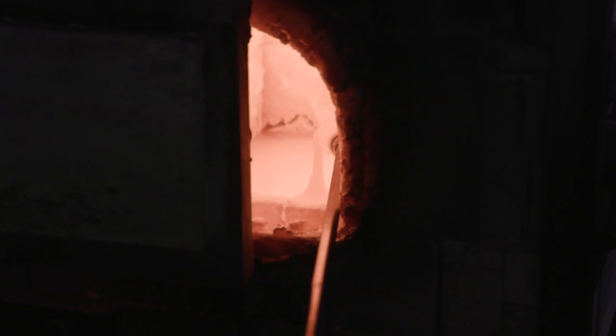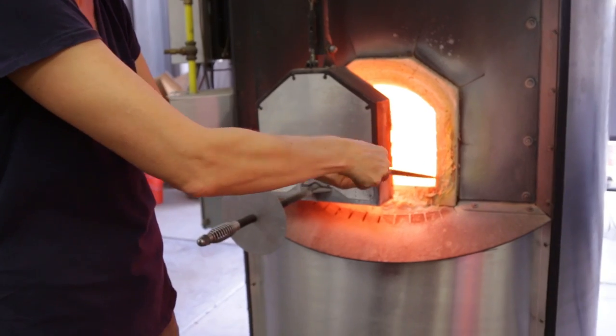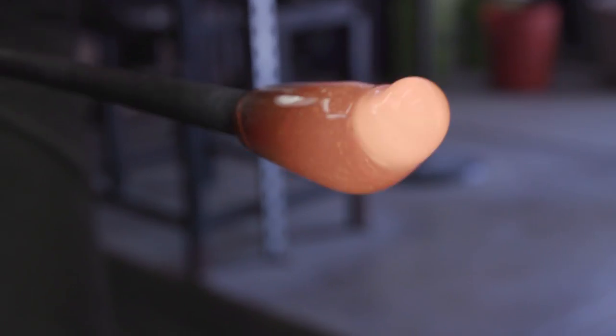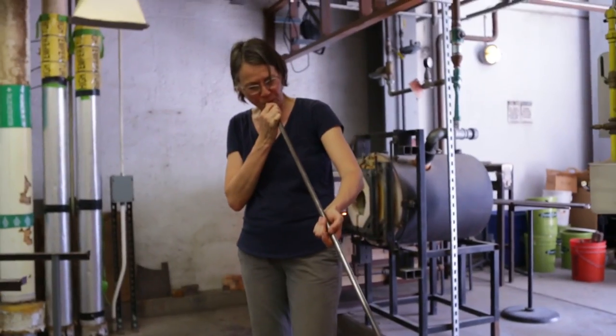So okay. We have a furnace full of molten glass. We actually have two furnaces, one with clear glass and one with black glass. How does this work? Like, just walk us through really simple steps. How do you make stuff with glass? Well, once you have the molten glass, we take a blowpipe, which is a steel tube, basically, and gather glass on the ends, kind of the consistency of honey. So it's like going in there with a honey dripper and trying to scoop it up. And then when you blow through the other end of the blowpipe, that glass will start to inflate. So it's almost like blowing up a balloon on the end of a long tube.